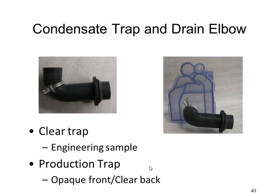The condensate trap in the photo appears clear, but it's actually half-opaque, half-clear. The engineering team wanted to make it clear based on dealer feedback so you can visually see if there's crap clogged in it — a fantastic idea. However, in field trials homeowners started asking questions about what was in there. The final result is that the front half of the trap is opaque — white or black depending on the trap — and the back half is clear. So the homeowner doesn't see anything, but the service tech can take a couple screws out, pull the trap out, look at the back, and diagnose a clog.